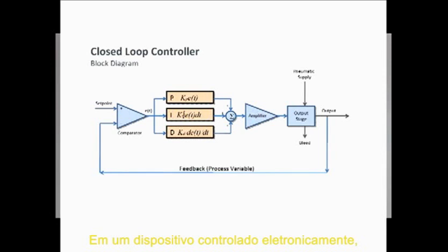In an electronic control device, a PID control system is included to improve performance and assist with adjusting the control process of a valve. PID is a control loop feedback system where a controller calculates an error based on the difference between individual process variables and a desired set point. The calculation involves three terms: P or proportional (present error), I or integral (sum of past error), and D or derivative (estimate of future error). The three variables are summed and fed back to the processor to adjust the control process.